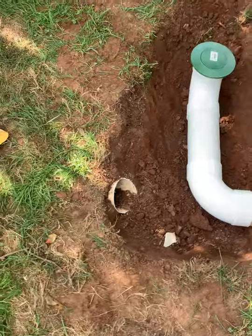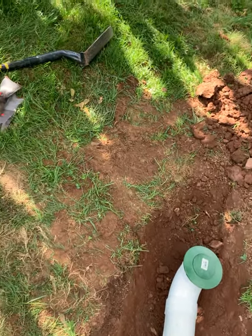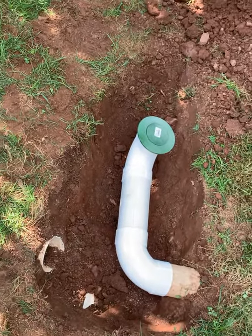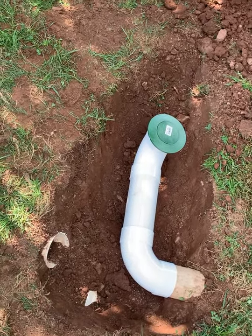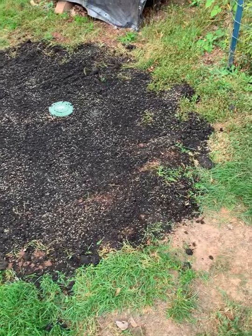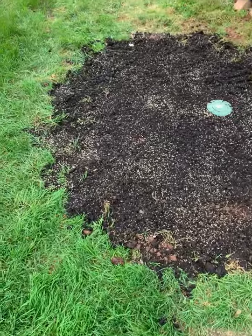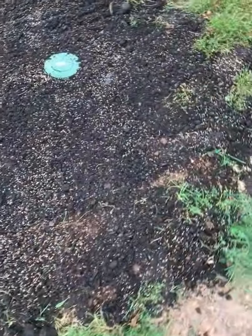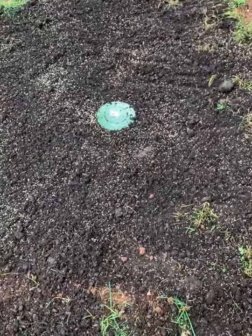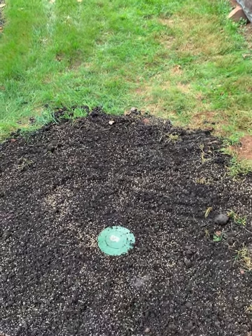Now all that's left to do is backfill it with soil, and then we're going to put some nice high-quality loam on top and reseed the area. As you can see some of the grass is sparse back here, so we're going to backfill with material we took out of the hole and then top it with some nice rich organic soil. So we put down the very rich topsoil, seeded it, and we'll just water it — project completed. You can see now that the pop-up drain, if everything works well, will be right there: water will pop up, come out, and go down the back of that berm. Thanks for watching.